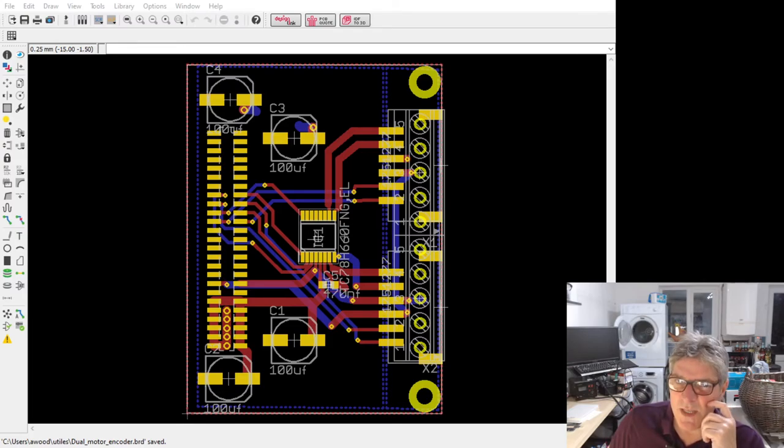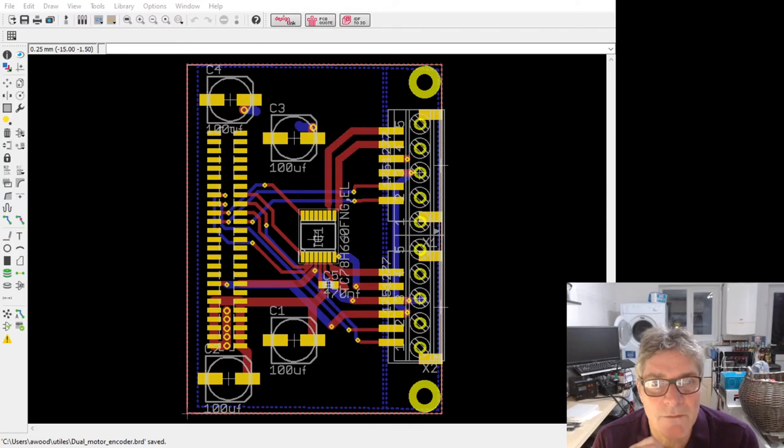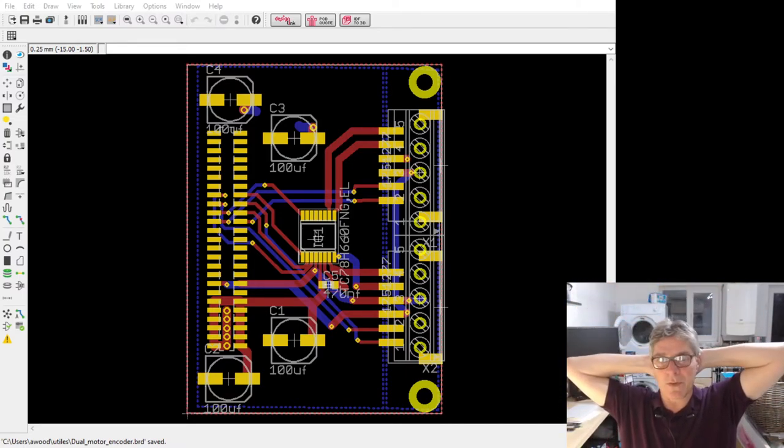I probably wouldn't do EtherCAT itself because that's quite an expensive way to go, but you can do something similar if you've got an FPGA. So what you could do is have two Ethernet PHYs potentially. Or you can get a double PHY by using a slightly different chipset. And then you can have multiple tiles with these on, and these can then be point-to-point kind of Ethernets for controlling, with PoE on the board.